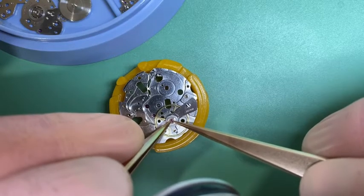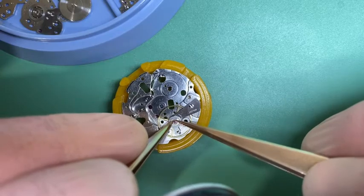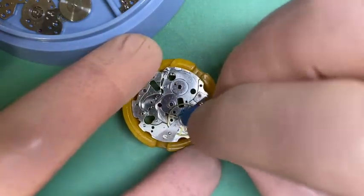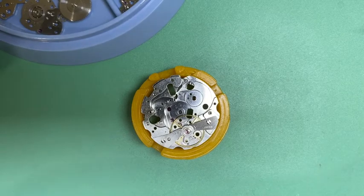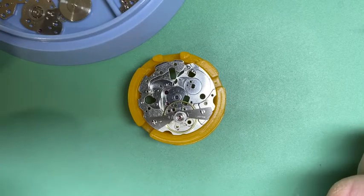We get two arms in, we spin, and we get a third in, and then we move it around to a safe distance. Just like that. Okay, I don't clean that with every part. It's a non-bearing surface, so it's not a big deal. So I always dab Rodico on there. But yeah, anyway. Okay, so now we can check the balance.